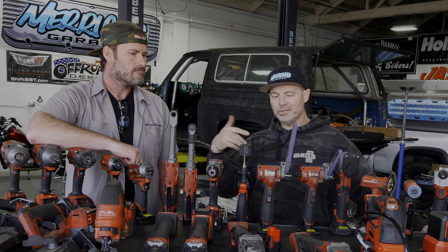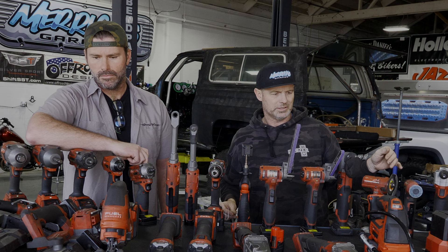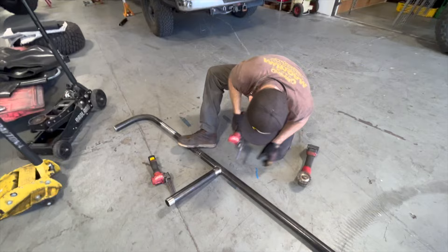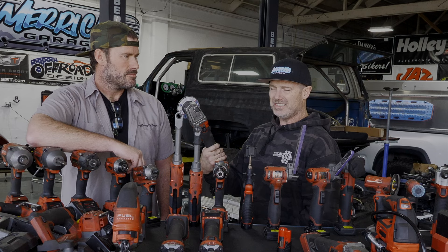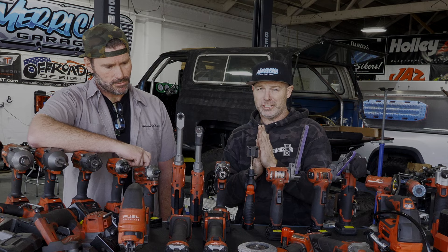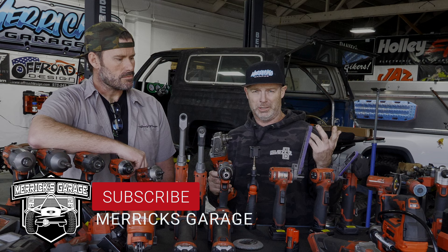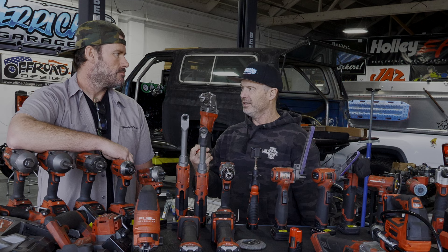This is basically my fab selection right here — my angle grinders, my dremels, my belt sanders, that sort of thing. This tool right here is probably 11 years old and hasn't flinched — we use it daily still. The rubber's falling off the head. Basic fabrication starts with the ability to cut metal, and that's what an angle grinder gives you by swapping out from a flap disc to a cutoff wheel, to a wire cup or wire brush. It gives you so much ability to cut metal, shape it, grind it, contour it. Next to a drill, this is probably the first tool you should purchase.